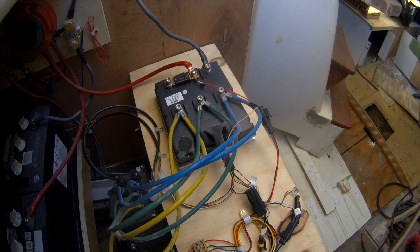To make matters more confusing, there's a bunch of error codes where the controller behaves exactly the same, going from one beep repeatedly all the way up to 14 beeps repeatedly. My unit was beeping 16 times repeatedly, which is not listed in any manual. It turns out that 16 times means the brake is on. I don't know why they'd program the controller to beep like an error code if your brake is on, but that's what they chose to do and it threw me for a loop.